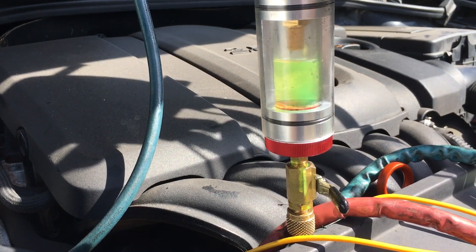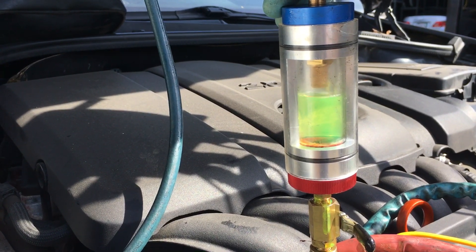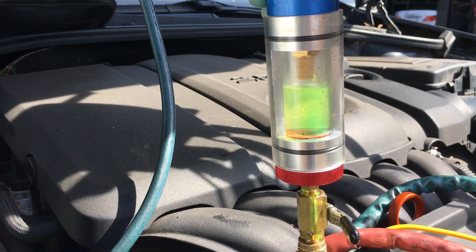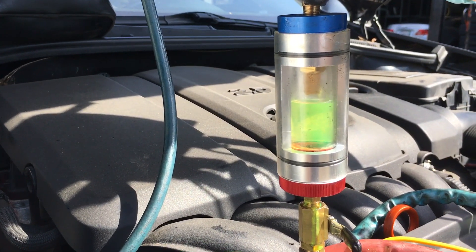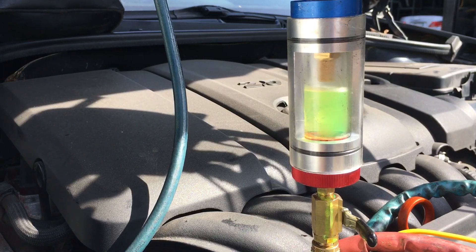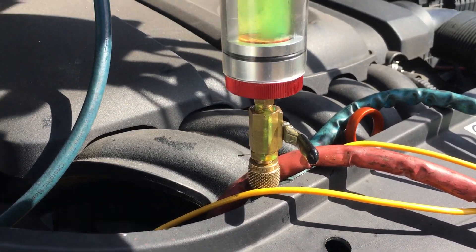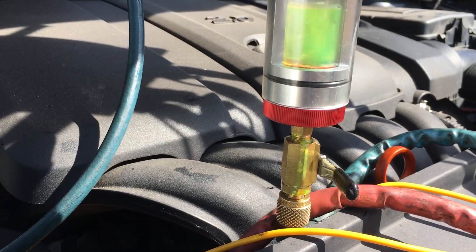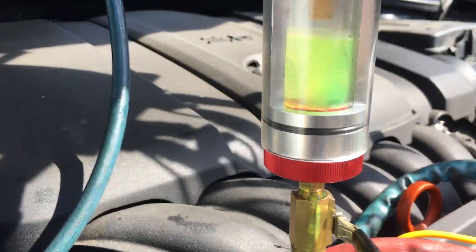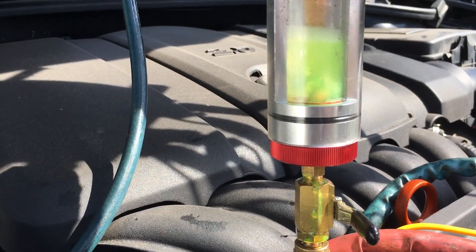I want it less than that because I don't want to bring out the oil. I want you guys to see the bubbling — I have the valve cracked a little bit and it's outgassing. This is touchy. I'm afraid that once I go to a certain point, it's just going to outgas really fast. Let's see right there — I'm slowly boiling off the refrigerant, it's boiling right now. I'll see if I could speed this up without sucking liquid out of there. Let's see if I could crack it more — there we go.